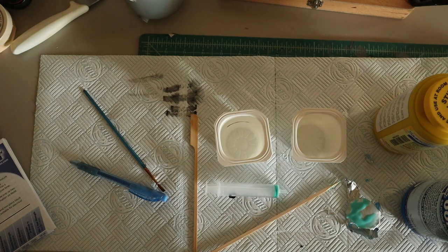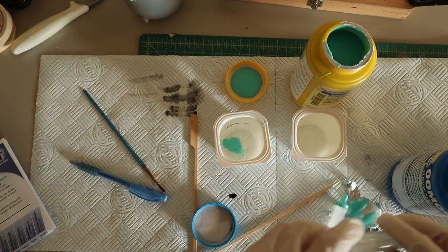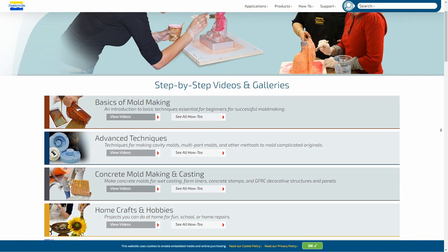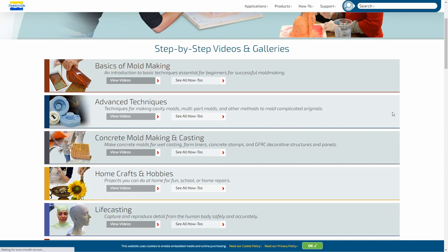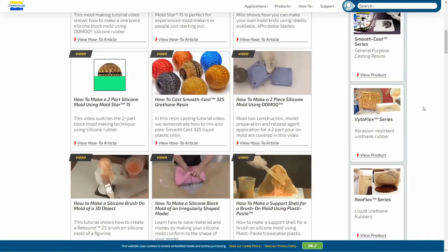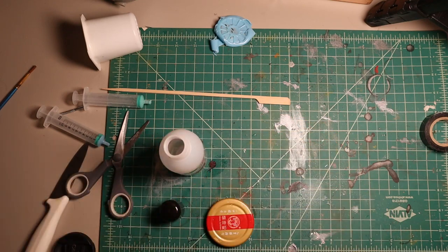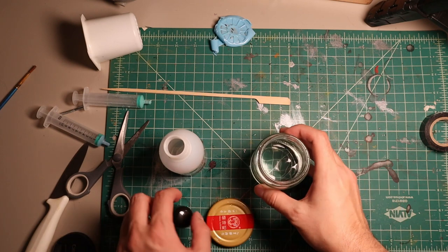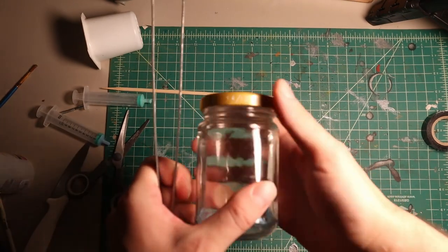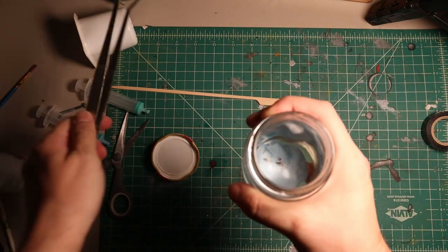As an experiment and practice for silicone mold making, I mixed up a tiny batch using some custard pots — a good reuse of some trash I had laying around. I must commend the Smooth-On company because they have an extensive video tutorial library on their website. I put a link to these and to the exact brand of silicone I'm using in the description. The recommended curing time is 6 hours, so I waited that long, then got it out and put it in a glass bottle of acetone overnight, anxious to see if there was any damage. Fortunately there was no visible change to the piece of silicone. I had some backup plans such as testing various 3D printer plastics or even CNC milled metal molds, but fortunately I didn't need to go down that route.